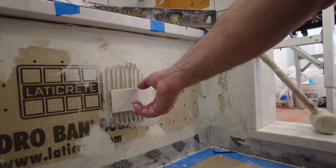I just wanted to make a point about back buttering because a lot of people say you have to back butter every single tile, otherwise you're not going to get good adhesion or coverage. That's not always true — many times you don't have to back butter. If you're not sure, just spread some thinset, set a couple of tiles, pick them up and check your coverage. If the tile is flat like this, you should be good to go. Thanks for watching.